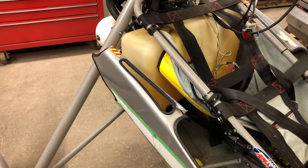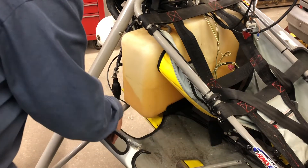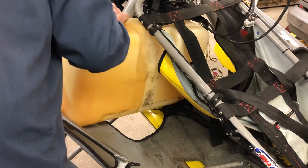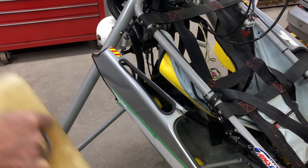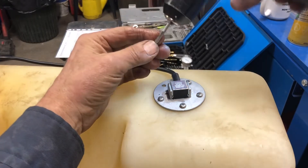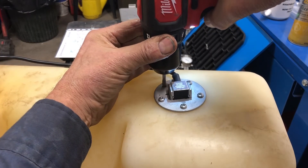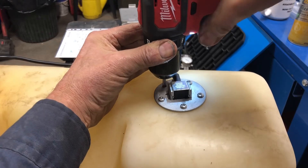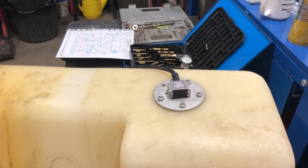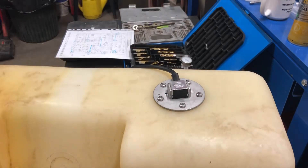Now that the strut's out of the way, very gently and slowly move this down — it's all loose at the front because the instrument panel is out, which actually helps. I pre-drilled the hole — I know you shouldn't use a tap in a drill but it's plastic, so I'll run it through and reverse it out. Then we'll take the last screw and do a test fit — and look at that, perfect! Of course there's no gasket in there, so I have to take it out again because I've got to wash it all out.